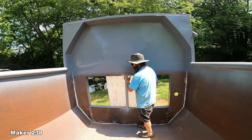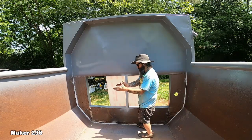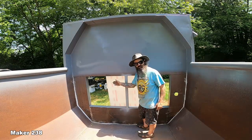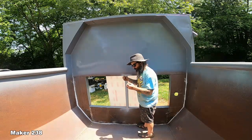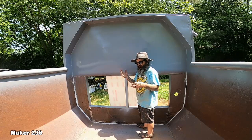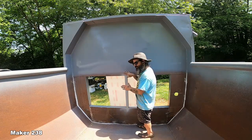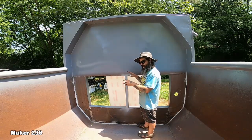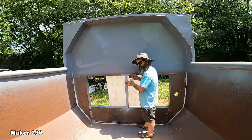The adhesive is so strong, and the pressure of the water is constantly pushing this way. I won't have any forces pushing out onto those bolts. The bolts are helping the adhesive, kind of giving them some reinforcement, but also hold it into place when that adhesive cures. Once it's done curing, I'm almost certain that just that will hold the Lexan glass up.